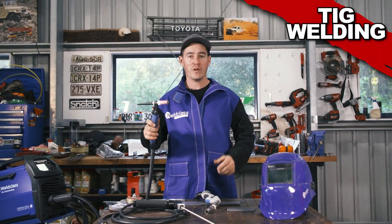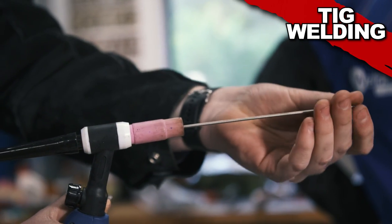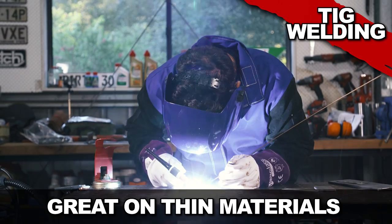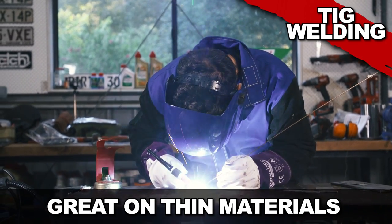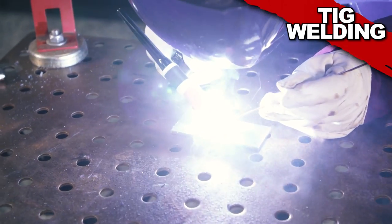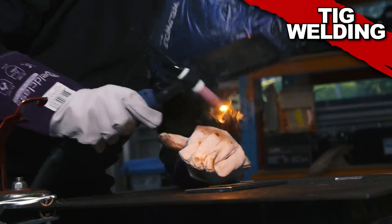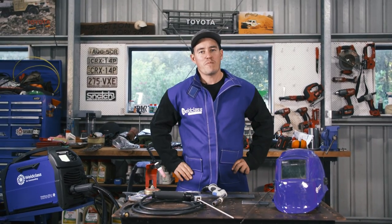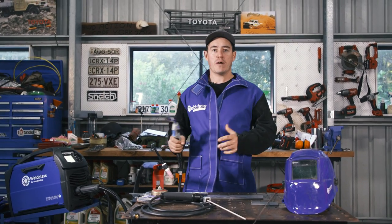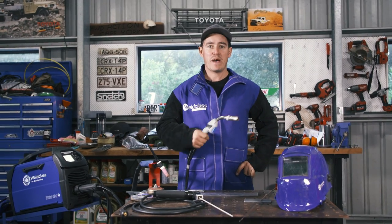And lastly we've got TIG welding. Out of the other methods, TIG is no doubt the hardest. TIG is excellent for controlling the heat you put into the job and is ideal for a neat, strong weld — often used on thin materials or where appearance is really critical. A lot of MIG or stick inverter machines these days have DC TIG capabilities, allowing you to TIG weld steel or stainless. You can also TIG weld aluminium, but for this you need an AC/DC machine. Without a doubt, MIG welding is going to be the best all-rounder to start tackling your own projects.